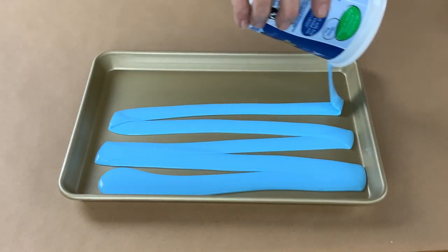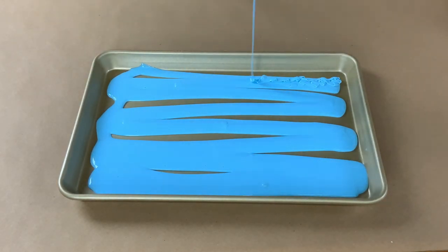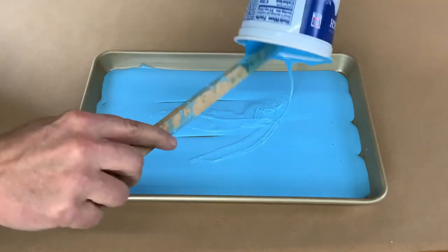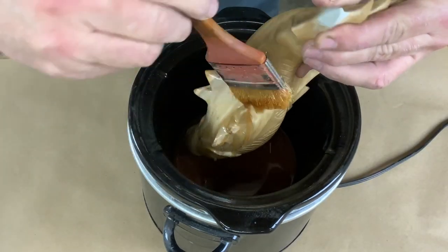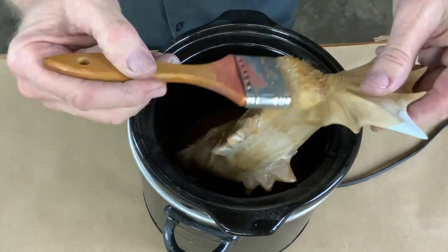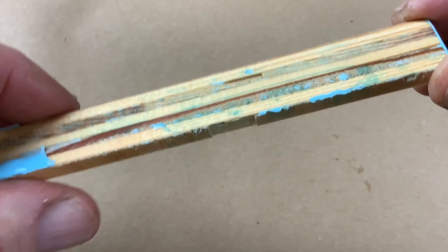I've never tried to make a mold like this before and I have absolutely no idea if it's going to work. But if it does, it could open up some new possibilities, so it's worth a try. To begin, I need to pour out two flat sheets of rubber. The fish is carved in wood and it's not sealed, and I never like to put rubber on porous surfaces. So it's time to give Mr. Fishy here a nice warm bath in melted beeswax. Silicone rubber can bond tight to the pores of untreated wood.